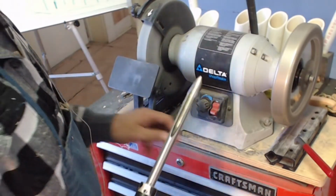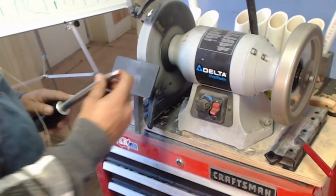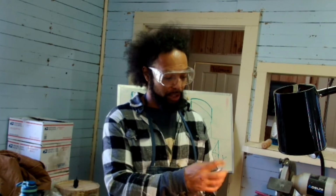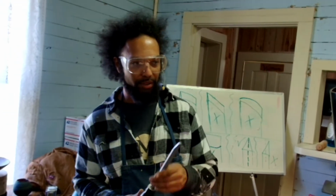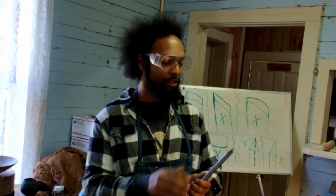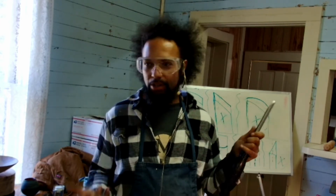What I'm looking to do is that when I'm grinding the left wing, I'm swinging towards the center here. The reason I start at the wing and not the nose is that if I start at the nose, I'm placing too much pressure on it, and being that there's far less steel this close to the flute where it's not as wide, it's going to split right in half. It'll split that nose in half, and you have devil horns on both sides. That's not what I want to do. Whether you're grinding with the jig or freehand, you have to start with the wing and swing it towards the center. Other side, start at the wing, swing it towards the center, and that's just a little overview of that.